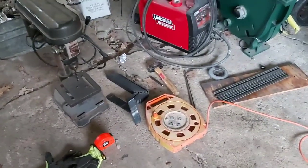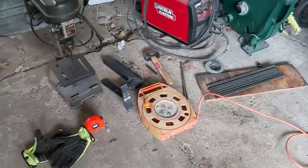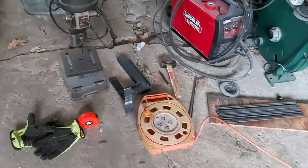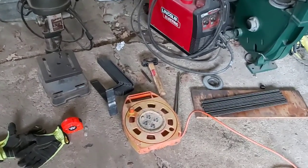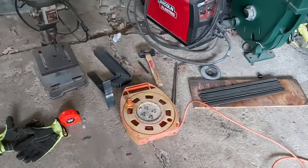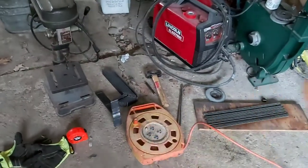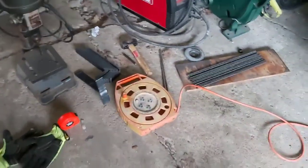If you need more than 100 amps from it, or whatever a 4-gauge wire can handle, I would say 100 amps, no problem. You could probably push to about 150, but I wouldn't do that continuous. But yeah, it's quite a load at 48 volts. That's like 4,800 watts or so, and that'll be just one. So the whole system, the battery bank will be able to handle, say, 300 amps continuous. They will all share.